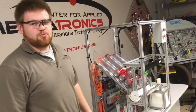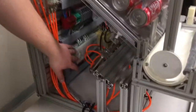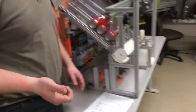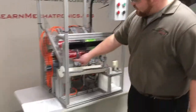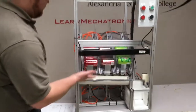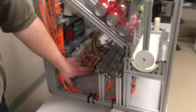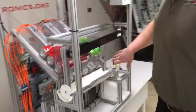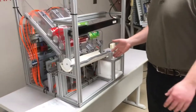I was in charge of the PLC programming and the electrical schematic. We used MicroLogix 1000 analog for the programming, and we used RSLogix 500 on the computer. So the process is, when the Coke button is pressed, this cylinder will go down for a set amount of time, and then once that timer is done, it will trigger the back cylinder to go down, and as soon as it hits this reed switch down here, that will trigger this to come back up. After that, the photo eye would be blocked with a can, and that will trigger this cylinder to slide to deliver the pop can.